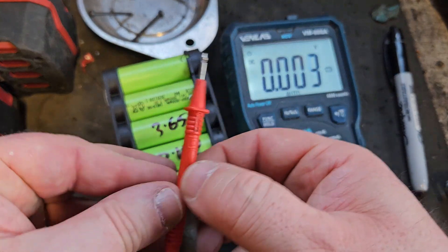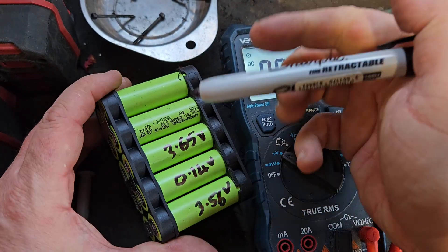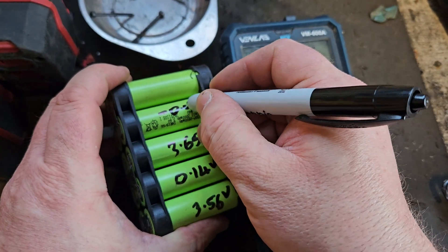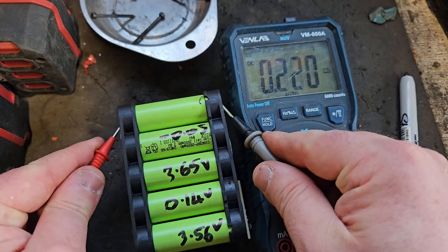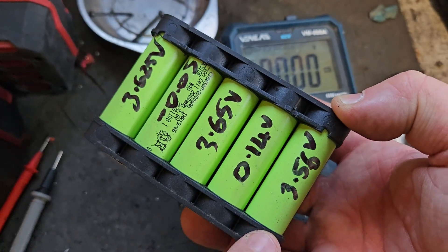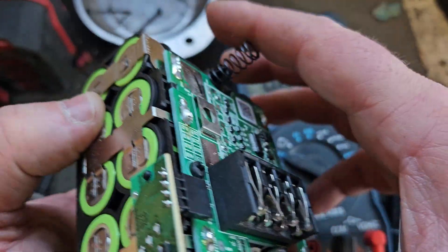There are balance problems across the pack with the good ones too. And that's what I was talking about — you can see the way that's showing a negative voltage. That is actually so bad it's reverse polarity, and it'll be pulling down the voltage. It's minus 0.05 — so that's quintessentially less than nothing. The other readings are 3.62 and 3.65. So you can see the problems there: with those banks of cells, these two are gone, and that's how you establish that you have bad cells.